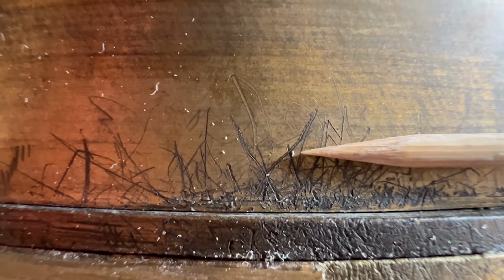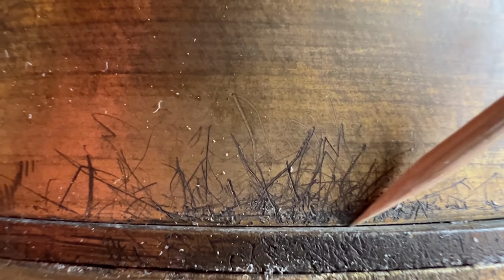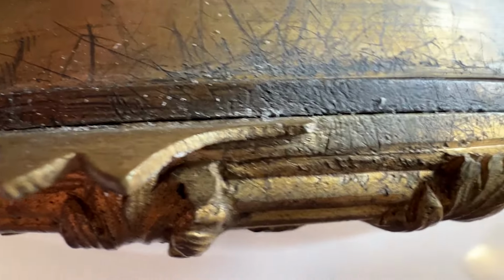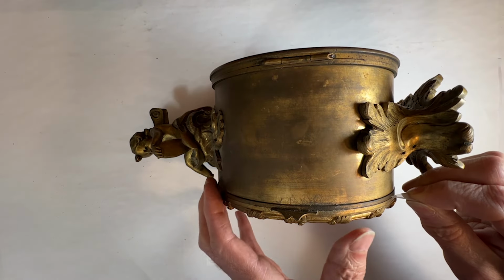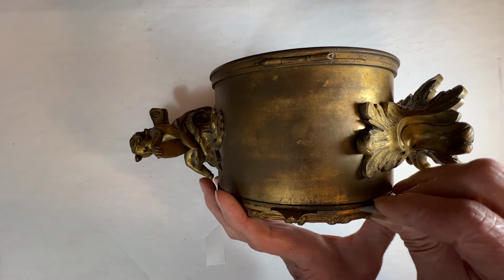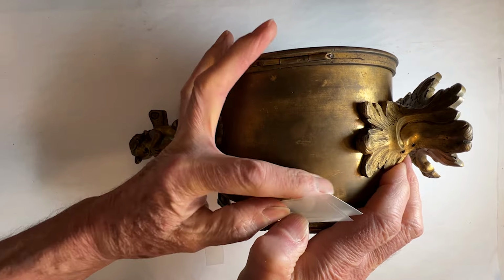These scratches on the case look like someone was attempting to open the front from the wrong location. This joint is where the trim meets the side of the clock case. It's not the bezel. This joint here is where the bezel meets the case trim and is where it opens from. I've not had it opened yet, and the bezel to case trim fit up is tight. So to prevent any scratches or damage, I'll use several pieces of mylar to help get it started.